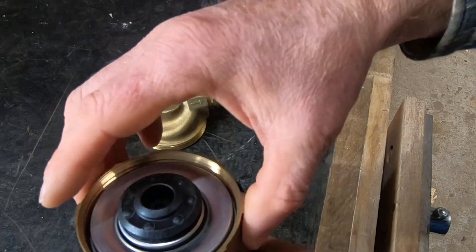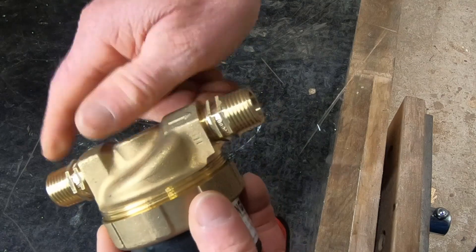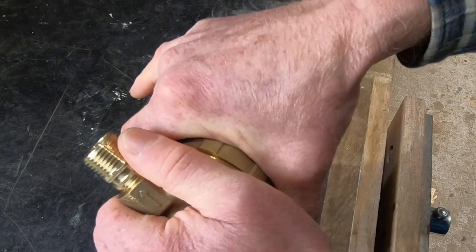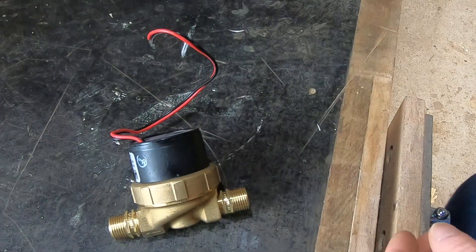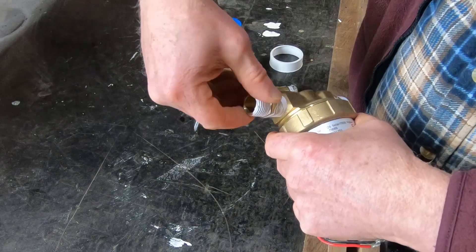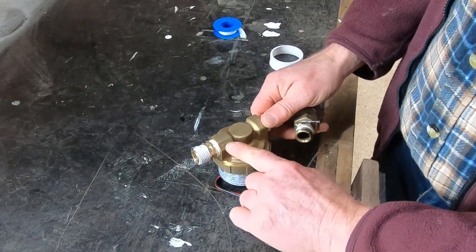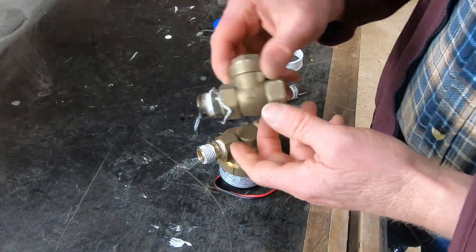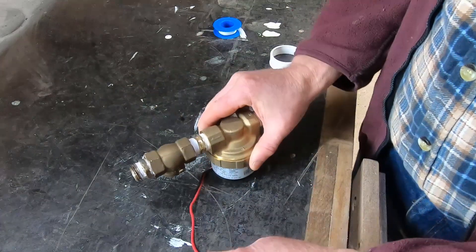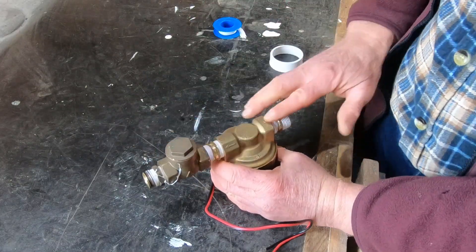It's driven by magnetic induction. These will start at just one watt, so very little power is required — the sun just has to barely touch the solar panel for them to start ticking over, and of course the more sun, the stronger they pump. Now I'm going to dress it up and get it ready to install. Thread tape is essential. One element to consider is the direction of flow, which is marked on the pump with an arrow, so the non-return valve will go on that side. I also need to consider the orientation of the pump, running it horizontal.